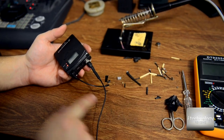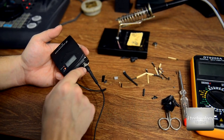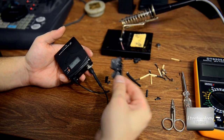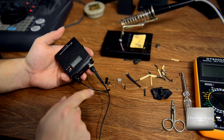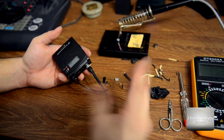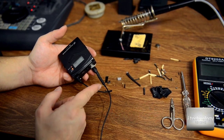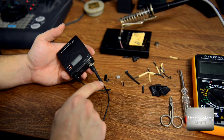I inserted two big shrinkable tapes and one small shrinkable tape. After making the connection and solder, I inserted a small duct tape, then used the thermo-shrink tape — the small one first — and then two layers of big tape. You shrink the second layer of the bigger tape and it will shrink over the small shrinkable thermo tape.